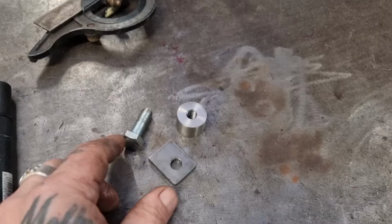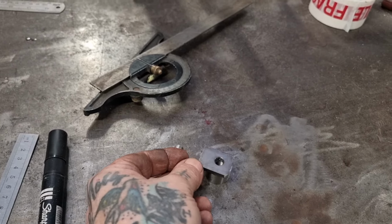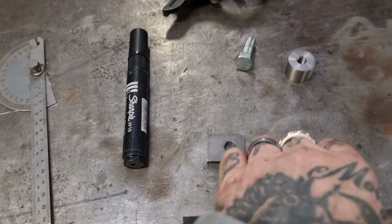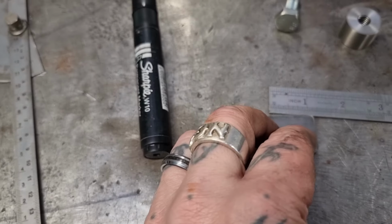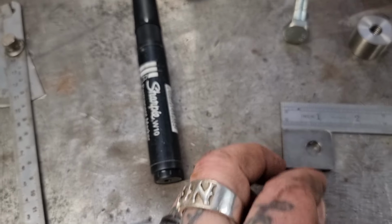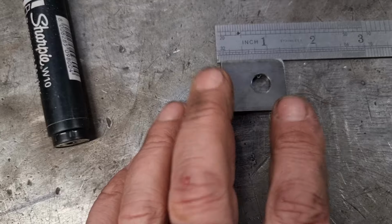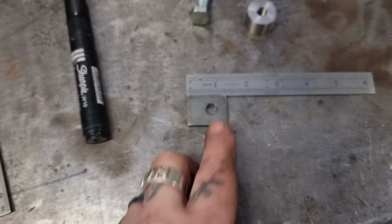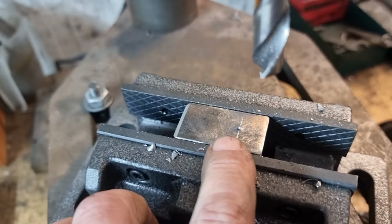Alright, next up, these are my usual brackets that I fit on everything, but that's not long enough for 1¼ inches, I think that is. Where are we at, look, that way around. 1¼ inches, yeah, just under. I'm going to go inch and three quarters. I'm going to cut 1 inch and three quarters, and then we'll whack a 10mm clearance hole in the end. Righto, with that one cut longer, centre marked.